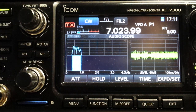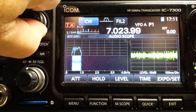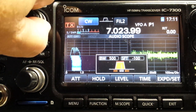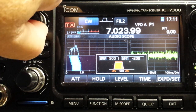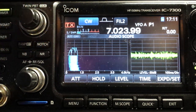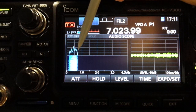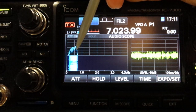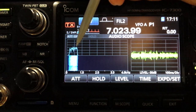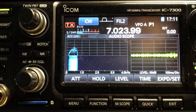And this is your oscilloscope. Now this is actually what's coming out of the speaker of the radio — this is not the IF, this is actual audio. We're going to rotate to the left and you can see what is actually happening. We've moved our noise down to a lower pitch, we've cut off the higher end of the spectrum, and we've maintained our selectivity.